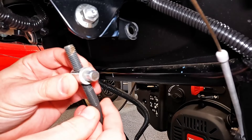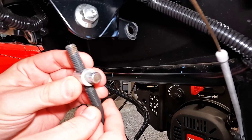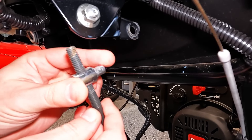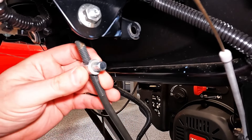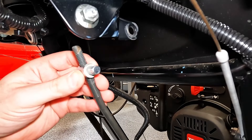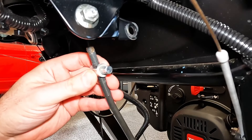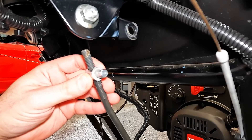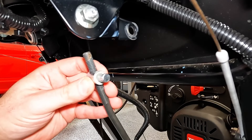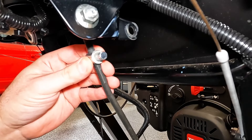When you remove this, it's threaded on the end, so you can adjust it. When you turn this clockwise, it will shorten the rod and will make the transmission — or each gear — go slower. If you turn it counterclockwise, it will make it go faster. Whatever your dilemma may be, if you find it's too fast in first gear, put it in first gear and just try adjusting it. This is basically just trial and error, depending on how far out of adjustment yours may be. This is really common if you have these delivered to your home directly and assemble it yourself — sometimes they can be out of adjustment.